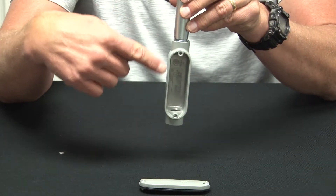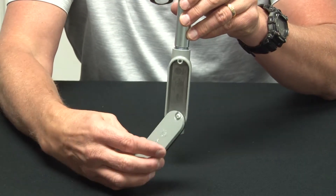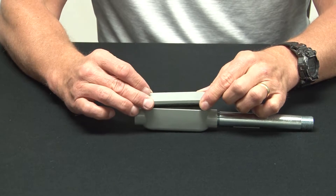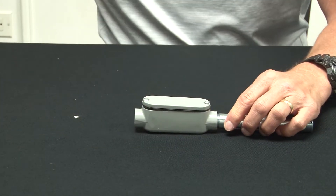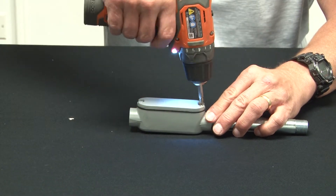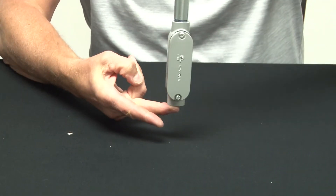When you finish pulling the wires and redistributing it, passing it through the conduit body, simply take the cover, align the rubber gasket with the edges, take your screw gun, tighten it down, and you have a nice sealed junction box that's a straight pass through.